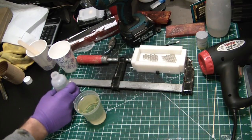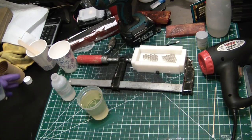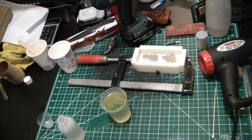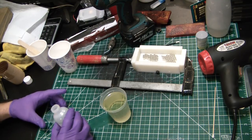I'm also going to mix a little slower. So we're going to see how this all works out. We're at about six and a half, so we'll go to the eight — that means we need two and a half cc's with one percent MEKP. I think the last pour we were probably well above that.